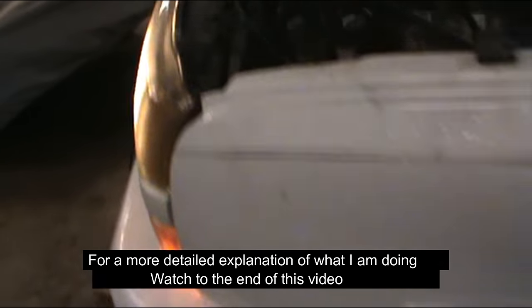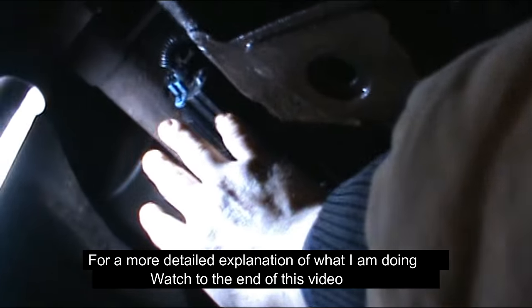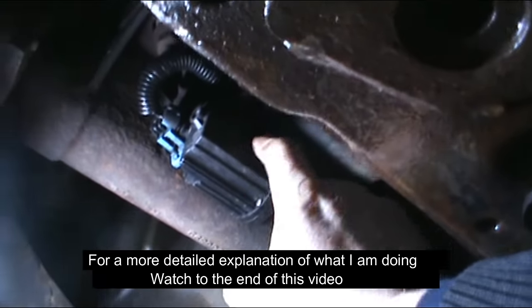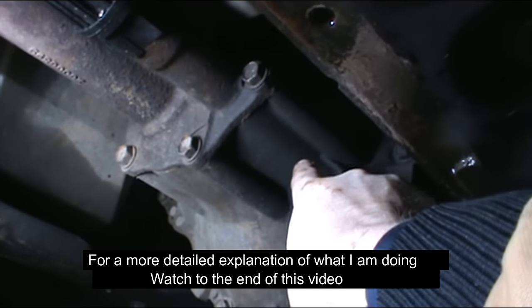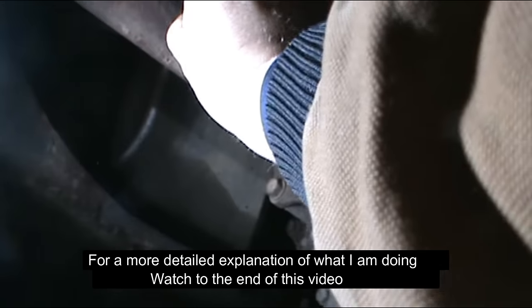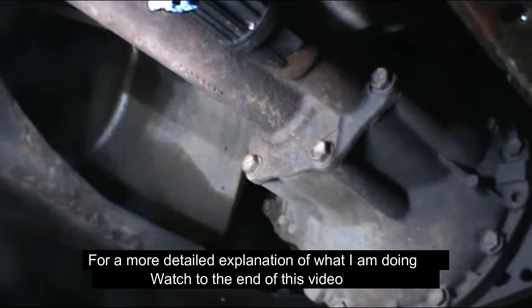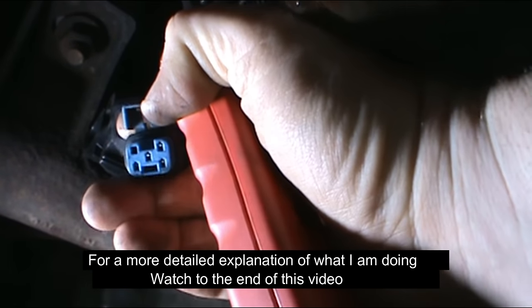I still haven't put my dash together, but the battery ignition is in the on position. Getting back under the truck — I've got the side jacked up just so it's easier to film. On the Z71s there's a skid plate in this area, but mine doesn't have it since it's not the off-road package. What we're looking for is this — your front differential actuator. It's a little electric actuator that pushes into this pipe and pushes the gears together so that your front axle is turning. Just take your thumb and pop that connector right off.